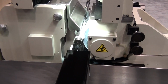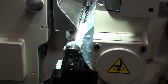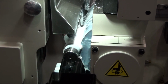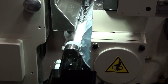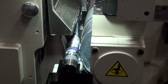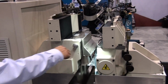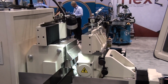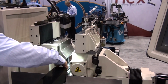The 1.5-inch diameter part is ground on 2 diameters with a large diameter head which remains unground. The grinding wheel form is dressed with a single point diamond traversing in an over-the-wheel template profile. The regulating wheel is also dressed with a template trace and a single point diamond. These wheel dressers are used in motor drive with ball screw automatic travelers. Ram bed position is coordinated with the Parker motion control.